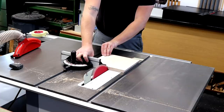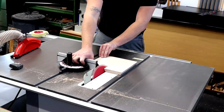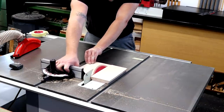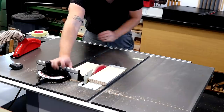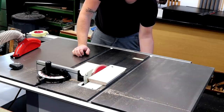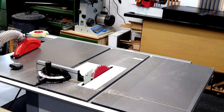When I got to cutting the final segment I realized it would have been much more comfortable if I'd started with a longer workpiece so that there would be more of it referencing against the miter gauge. My hands were also closer to the blade than I'm really comfortable with, but I just took the cut slowly and carefully, and I had to remove the crown guard for this cut because it would have gotten in the way. I definitely recommend starting with a longer workpiece, and I'll include some recommended dimensions in the project plans.